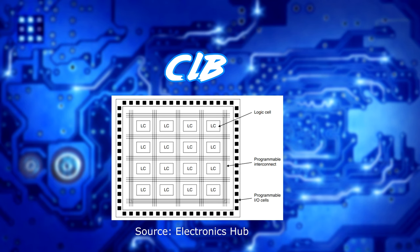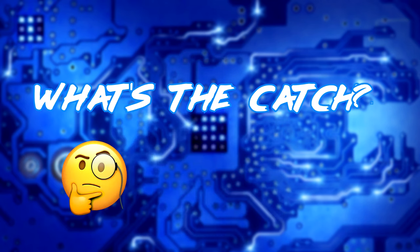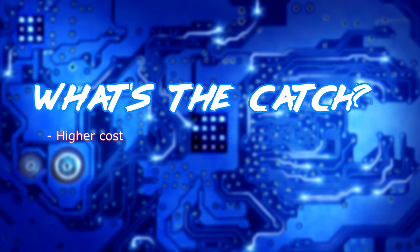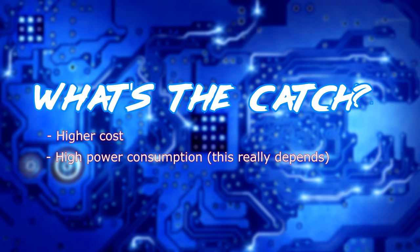You may be wondering: what's the downside? It seems like this is the perfect sweet spot — why isn't everything programmed on FPGAs? Some of the cons are it's higher cost than, say, a microcontroller, and it's high power. While you do get the benefits of performance and reconfigurability, there's a higher power requirement because the complex hardware that makes it reconfigurable is typically more power-hungry than an ASIC, while at the same time costing more than a microcontroller. But overall, it's a good choice if you need high performance in a small package for a reasonable price and you want it reconfigurable for the future.